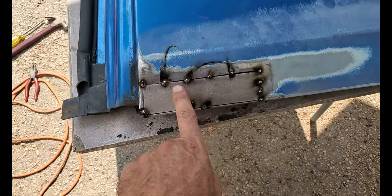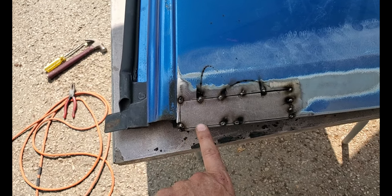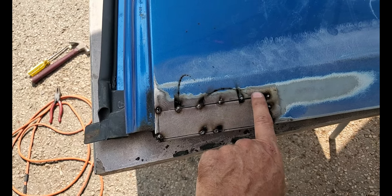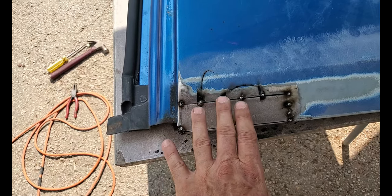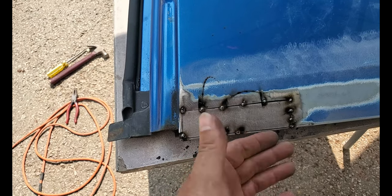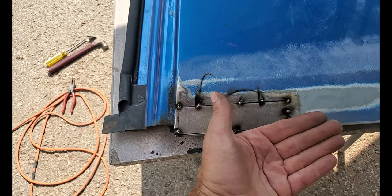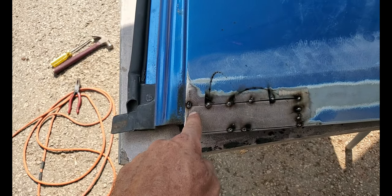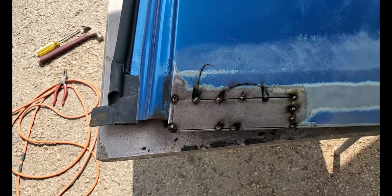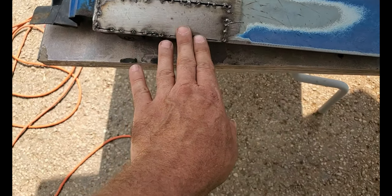About the patch — if you can get it flush, that's great. But if it's under at the bigger cracks, it is what it is. If you're going to do anything, let it sit low as opposed to sit proud or sticking up. You can always fill it in — it's a real pain to have to hammer it all down to the same height and then fill it in. Got some tacks on, cool it down with compressed air.